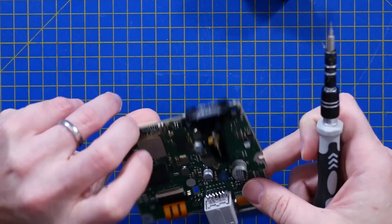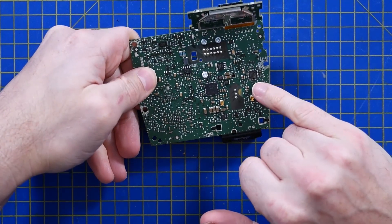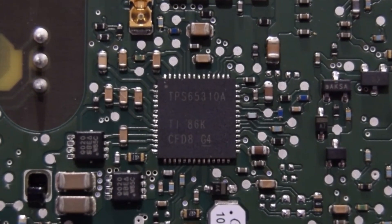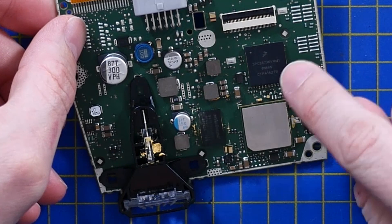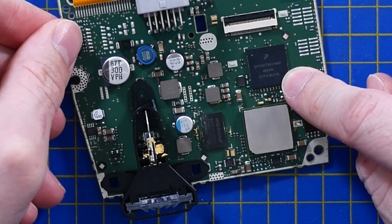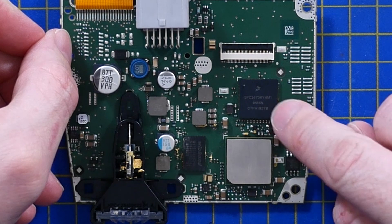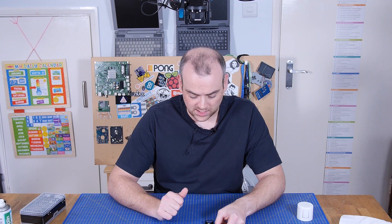There are two major ICs on this side and all the heat-hungry ones on the other side. I didn't find any information on that IC down there. This one is an automotive high voltage power management IC, which makes a lot of sense. On the top side, this is memory. This is a 32-bit automotive microcontroller with an awful lot of power in it just for a microcontroller. Interestingly, one of the IO options it has is CAN bus, which leads back to what I was saying - most of this processing seems to be done locally.